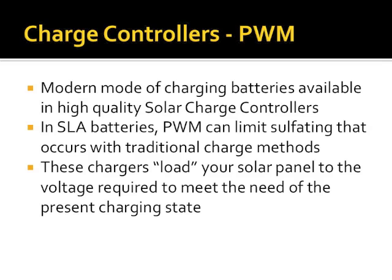They have a downside though because, when you plug a solar panel into them, a solar panel has a nominal voltage between 14 and 18 volts when there's a load on it. But when you plug it into a charge controller, it brings the voltage of the solar panel down to whatever the voltage is for the charging stage. And what that means is you could be missing out on power, which I'll show you a power distribution curve here in a moment. It works fine, but it means you're not getting the maximum energy back out of your panels.